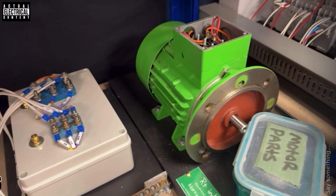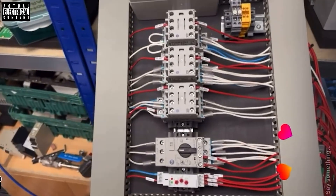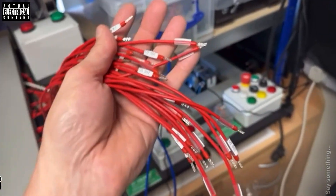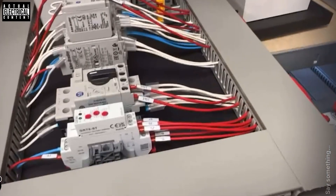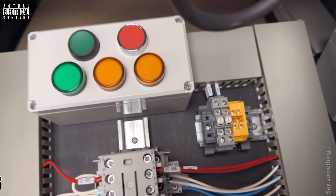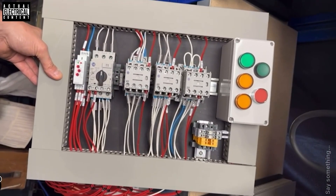There's also a sectional motor you can take apart and look at the insides of. This one here is a star delta test rig - you get to wire a star delta. But obviously it would get really expensive if people kept wrecking my contacts, so what I did was I wired all the terminals down here, and you get cables and connect them together with Waggos, which means people aren't unscrewing the terminals all the time. That was a very clever way of not wrecking really expensive contacts while still getting people to do a star delta. You get a green light for power, the star contactor, a star and a delta light, and it takes external connections.